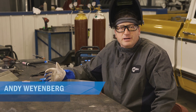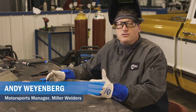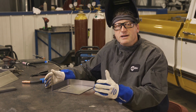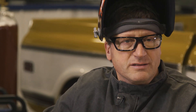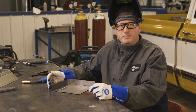When fabricating thin gauge material, sheet metal, or body panels, inverter type power sources are excellent when working with those thin materials, especially when MIG welding. Because when MIG welding, you really need that positive arc start. You really don't want arc starts where the welding machine stumbles on start, because you have the opportunity to burn through the material as the machine is trying to reach the proper amperage to tack those two pieces together. The Multimatic 220 AC-DC is an excellent machine when working with thin gauge material.